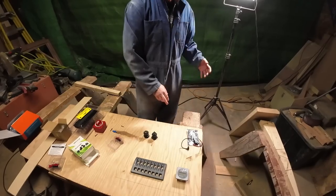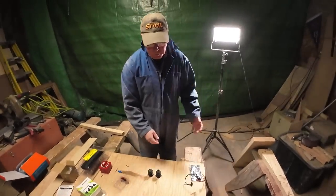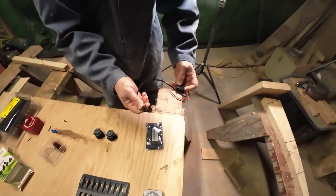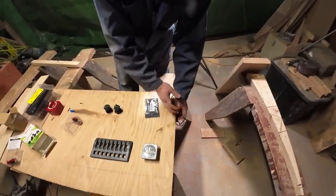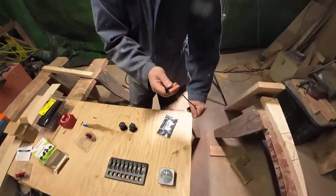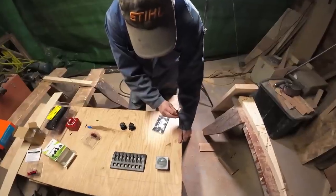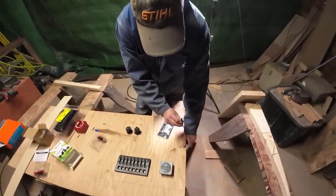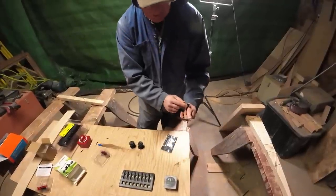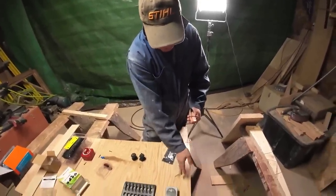We also will have receptacles over on the other side of the boat. So this is on the nav station. I do want to have a couple of receptacles over on the port bunk. And then this little USB-C is a hardwire version. So this would be mounted on the back side of this panel material. And then there would be a little hole drilled for this wire to come through. So all you would see really would be this wire coming through, approximately like this. And that's for my tablet to plug into. So I'll have a really nice sort of system to keep my tablet. In fact, I may even have a second one of these because the same connector can be used for my inReach. And I can have both of those mounted really on the watertight bulkhead adjacent to this.